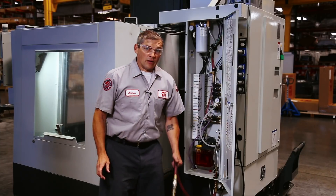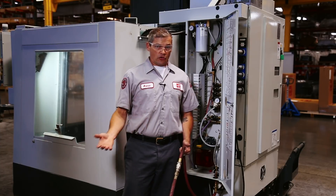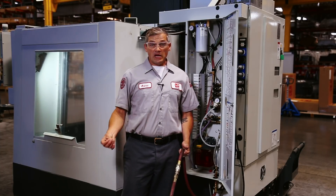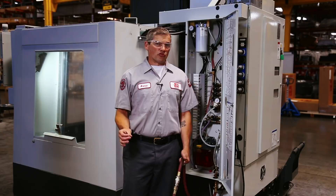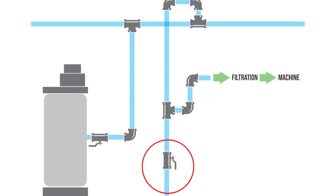Books have been written on designing and configuring the air system in your shop, so we're just going to mention a couple of things here to get you thinking about it. Make sure you've got properly sized air lines for the volume of air you're using. Minimize the number of fittings and direction changes in your air system. Put drain valves at the bottom of your air drops where water can accumulate and stay out of the path of the air.